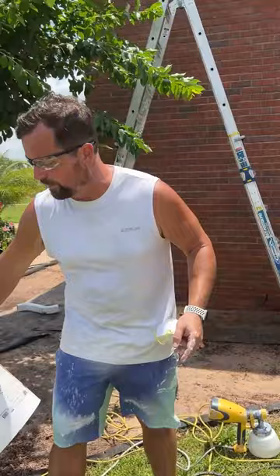I'm going back to the brush because the issue with the sprayer is that it's not getting enough lime into the grout areas. And if I hold the sprayer long enough to get the grout properly covered, then it's putting too much on the brick and it's pooling. You can see where the darker area is and where he's working with the brush now — whiter with the grout lines. When this dries the brick will get more opaque and whitish, but that grout is still going to stay darker and look really contrasty and weird. And it's going to make the second coat that much harder, so it's better just to do it with the brush.